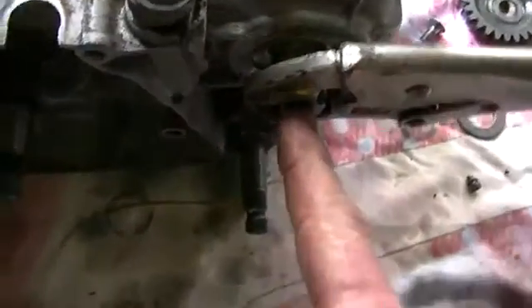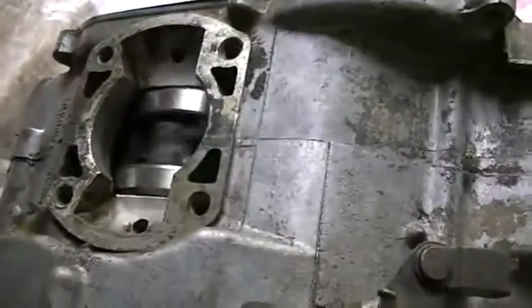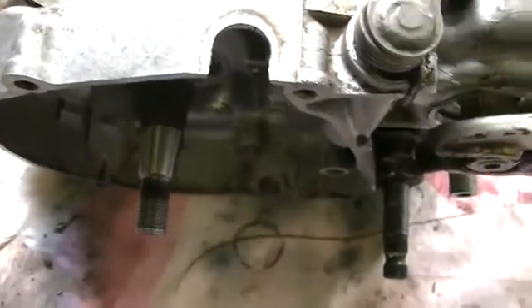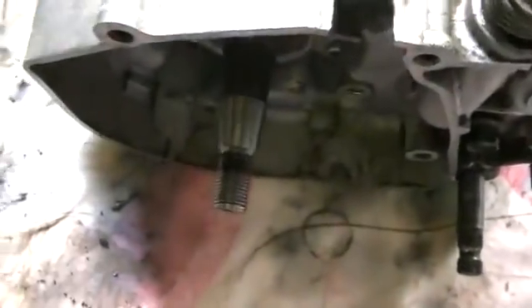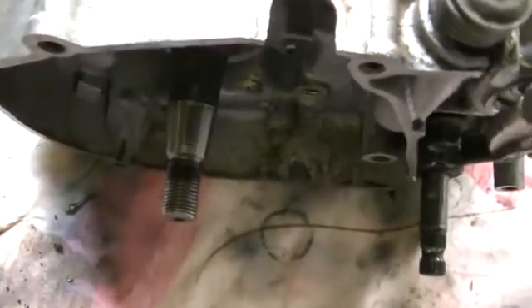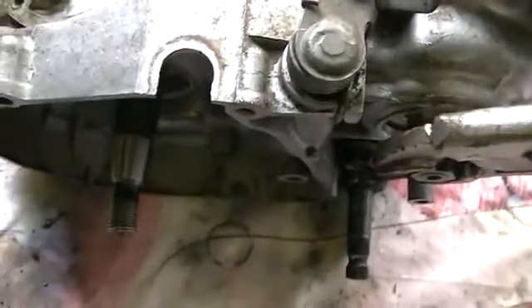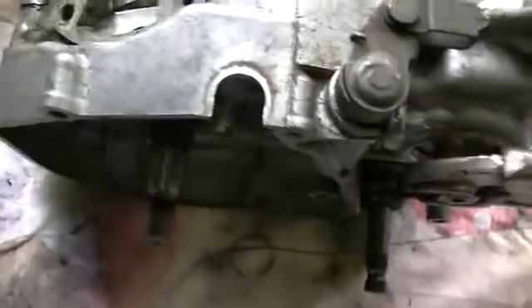Which means that we can gear this up by putting a small sprocket on here and a large sprocket on the drum, and if it's too high we simply drop it down a gear until such time as it drives most efficiently. This shaft here will of course be coupled to the generator itself, and around the drum we'll have our wire rope going up over a pulley and onto the weight. So far so good — that's very easy to turn. Doing well so far. Time to make up some framework and start adding some chains and sprockets.